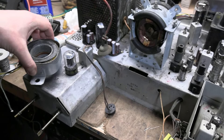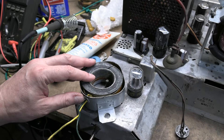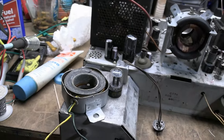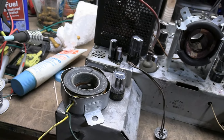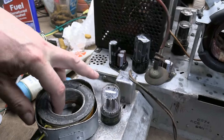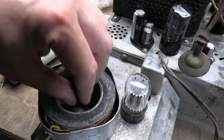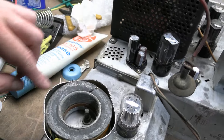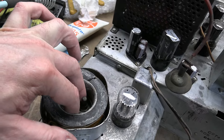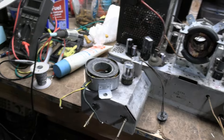You may have noticed that when I opened this up it was not potted with wax — it's just sitting in here. But it's held very tightly in place by the two halves. There's a phenolic ring around it; it's really held in place in the center and the outer edges don't touch. So this holds it firmly in place — you don't need potting. It's not floating around inside, so we're fine just leaving it like that.